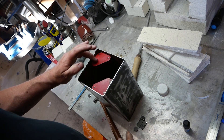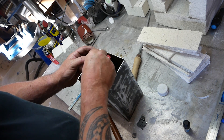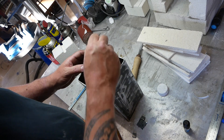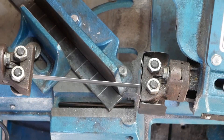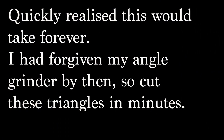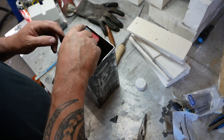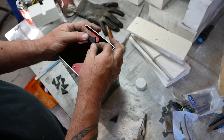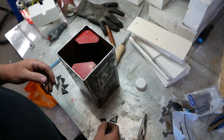The way I've decided to do it is using these welder's magnets so I can position a piece in order to weld it. I hope this is going to be good enough. Actually, what I really should have is triangular pieces — take two, rethink. Triangles are going to work a lot better. They're not going to work with these rounded corners, and I've just cut these with the angle grinder. So I'm going to clean them up and grind off the corner so they touch here and here. Let's hope geometrically they're sound.